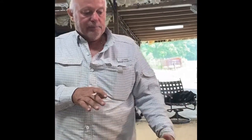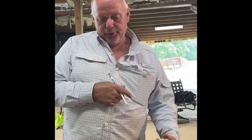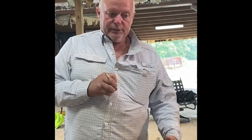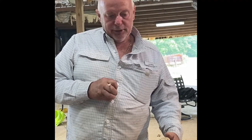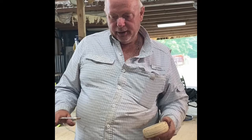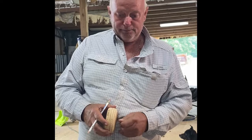Most inside-out people tape their squares together and put them in the lathe — that didn't work too well for me. They'd fly apart. Some people hot glue them together, some people use brown paper and glue. I'm going to eliminate every bit of that today. Even making the jig, it's still not going to take you as long as those other methods.